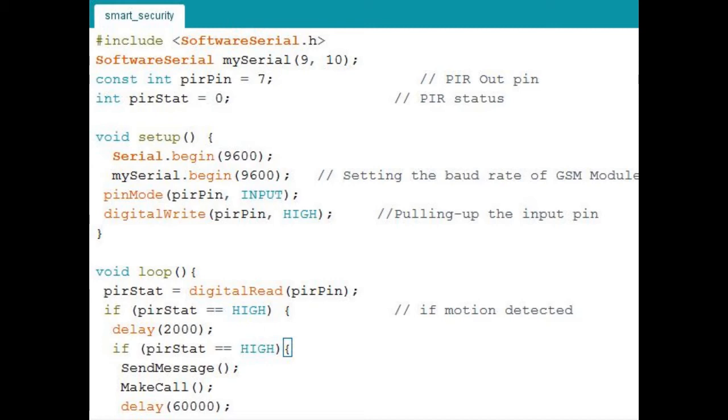As you know, the 9th and 10th pins are connected to TX and RX of SIM 900A in place of TX and RX. If you don't know why I am giving this connection, please do watch that video in the description section. Now I am declaring the PIR pin as 7. You know that I am connecting the 7th pin of the Arduino board to the PIR output pin. Now for the PIR status, I am declaring a variable and giving the value 0 to it.